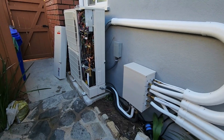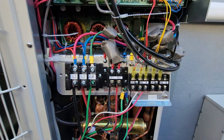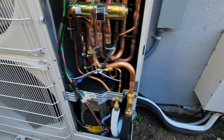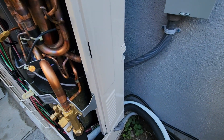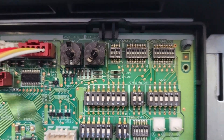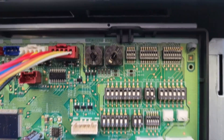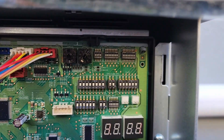The outdoor unit and branch box are all wired up. Main power comes in on the left, power goes back out to the branch box in the next slot, and the communication cable is on the third slot — all wires go down. Power to the branch box comes out of the side, communication cable out the back, and the power in goes through the disconnect into the one-inch knockout on the back. The address is set at 51 — remember, the outdoor unit uses 51 to 100, and the branch box uses 1 to 50. We set the branch box at 1, so the outdoor unit is at 51.